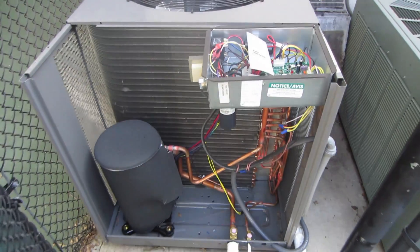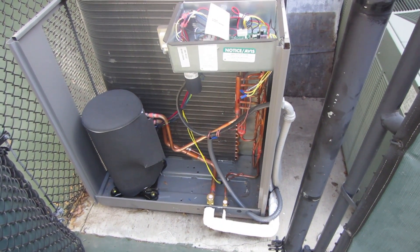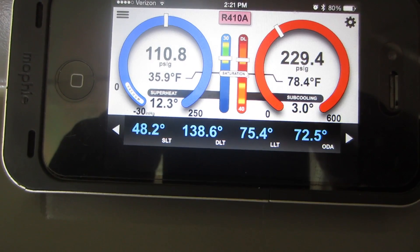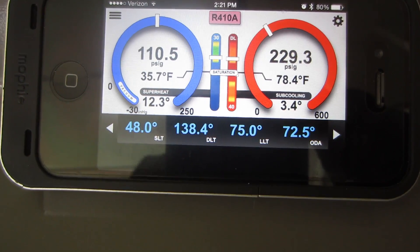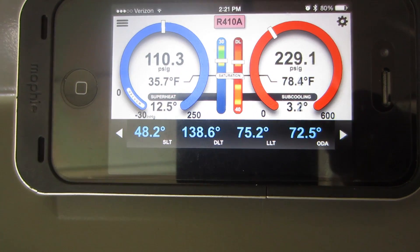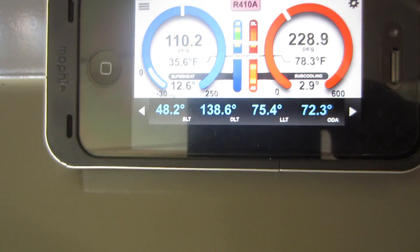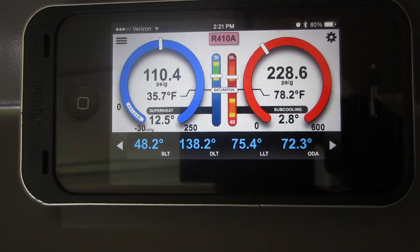It's going to be a great unit. I just got to assemble the fence, put it back together, and it should be up and running pretty soon. This is a beautiful thing — I've got the condenser running right now. It's a long line set on that five-ton. I initially put three pounds in, and it's probably going to take a couple more pounds. The subcooling is down pretty low. It's cooling fine, but it's a nice cool day out — 72.3 degrees.